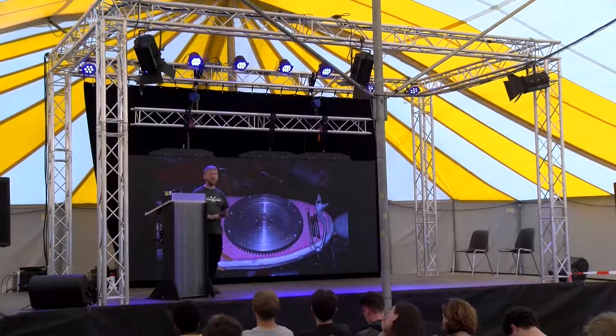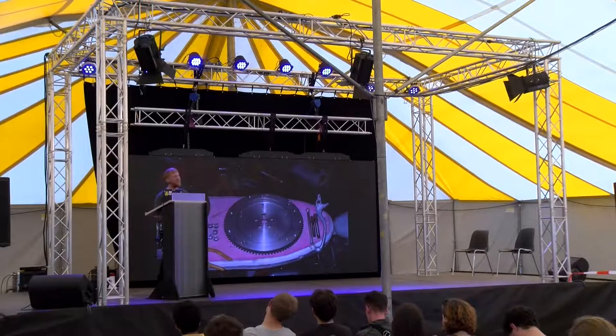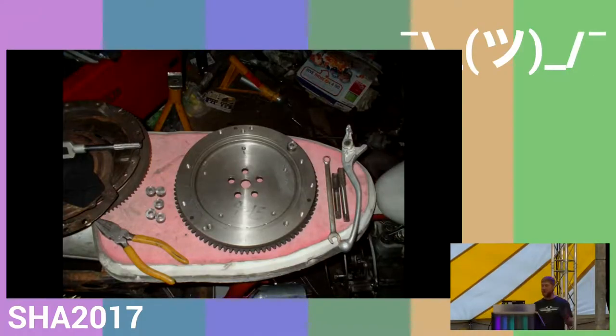So I restricted myself by trying to build the one out there, and I managed it without cutting, welding, extending the frame or altering it in any way, to see if any people over there would be confident enough to copy the idea and save themselves a whole raft of legislation and paperwork. Because of that, mating the gearbox and the engine together was done at the flywheel. There wasn't the room or the space to make an adapter, so I took the flywheel over to my friend Richard's house and turned it down on a lathe so it matched the profile of the flywheel that was on the original engine.